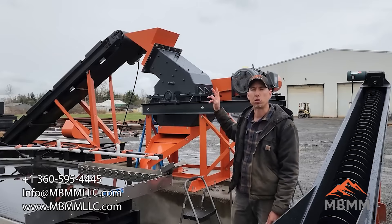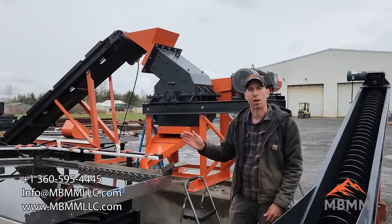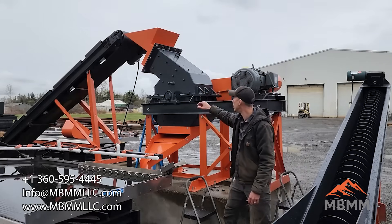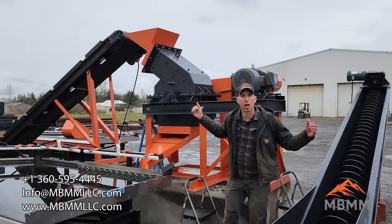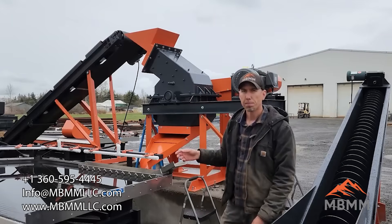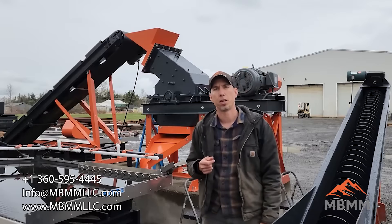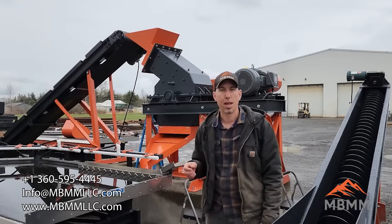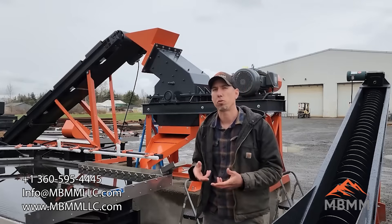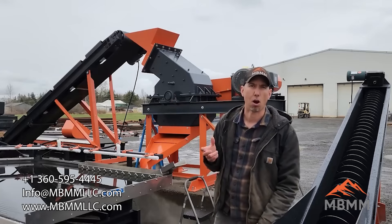On this system we add about two to three US gallons per minute to the hammer mill to make a nice wet slurry that feeds right onto the shaker table. We add a little bit of water down the top and also in the side of the case on both sides to help flush the material off the sides, keep it clean, and run it down through the screen. With a 0.8 millimeter screen the hammer mill will crush 50 percent passing 50 mesh and 30 percent passing 100 mesh at two tons per hour. If the ore is softer or more oxidized you can get more throughput and a finer crush. That screen size is for a nice hard competent quartz ore.